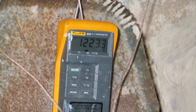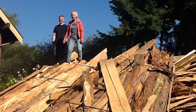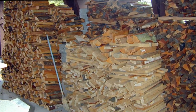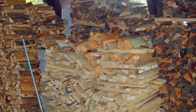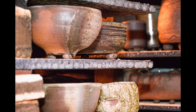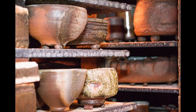The first high temperature fired kilns were tunnel kilns built into hillsides, called anagama, or cave kilns. The distinctive shape of these kilns and their specific location climbing up a slope work together to allow high temperatures to be reached over the course of several days or multiple weeks of continual stoking of fuel. The process created unique results, not only the vitrification of stoneware and porcelain clays, but the formation of natural ash glazes.